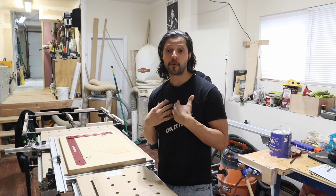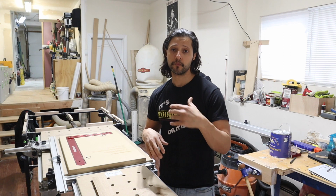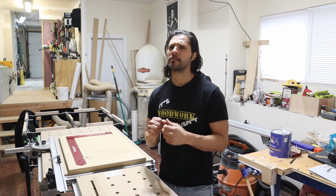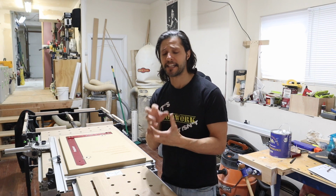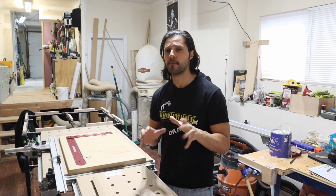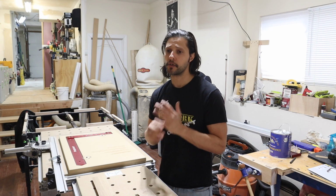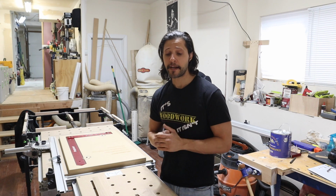But I had also a problem finding white oak plywood to begin with. They wanted white oak to match their floors and their stairs. So there was really no option to use red oak because it had too much of an orangey color in it. And when you put a finish on red oak, it gets a little more reddish and brownish tone than they wanted. So we went with the white oak, the clear poly over it, which was waterborne General Finishes. That's always a good finish. That was the High Performance. And we installed the shelves and everything came out great.